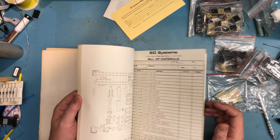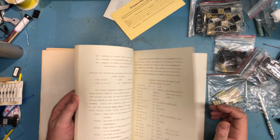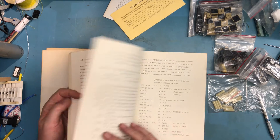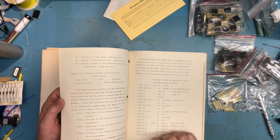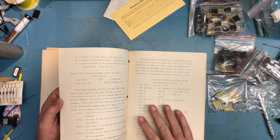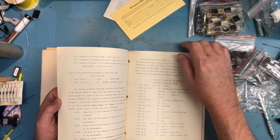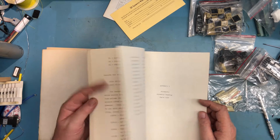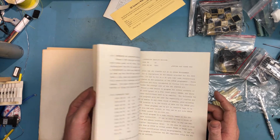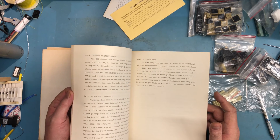This should be fun to put together — I am going to assemble it. I know some people will say to keep the kit pristine, but I'm going to build it. Interestingly, it can actually program EEPROMs on board. If I remember what I read in the manual, it essentially sits in the address space and writing to it fires off the whole 50 millisecond programming pulse — which is kind of cool. That could actually be useful, especially back in the day, as a way of programming a 2716 EPROM.